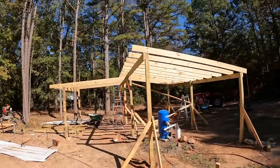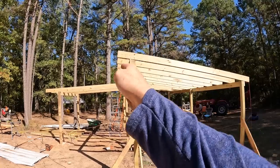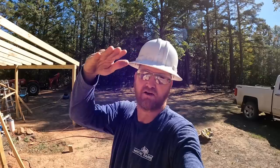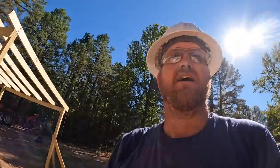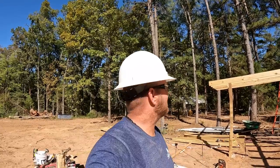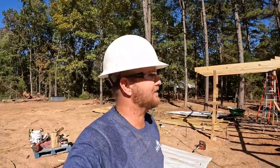On the next video, we're actually going to come up here and level down and cut these off straight and cut them to length. That way, whenever I put the soffit up there and the fascia board, I'll have a little bit of gap left over from where the metal will actually hang over. And on the low side, on both sides, I'm going to put a gutter system for water catchment for this building as well. So on the next video, we're going to straighten up the edges and make sure that we leave that necessary gap that we need for the fascia and the gutters.